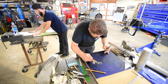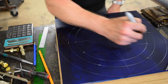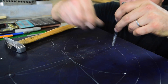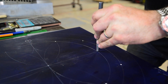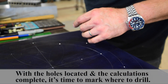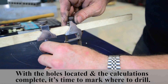I'm actually just using a sharpened pick by hand to start my center punch, and I've got a little jeweler's loupe — a little magnifying loop — that I use to get myself lined up. I found that even laying stuff out by hand, you can easily hold maybe five thousandths of an inch of accuracy, which for the purposes of this is going to be totally fine. So the first thing I do is take my sharpened pick and put a little dimple in.